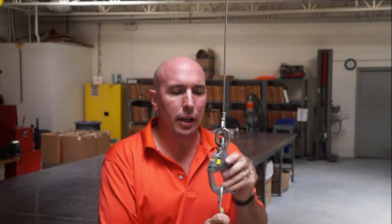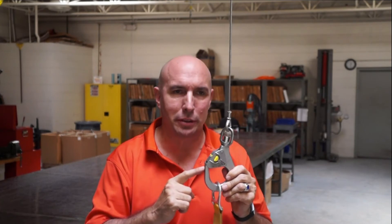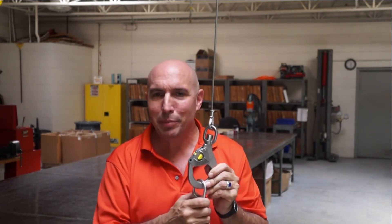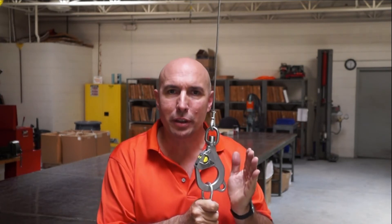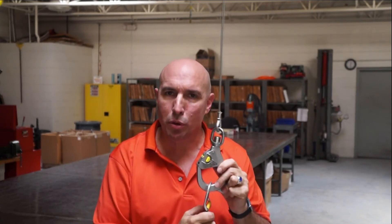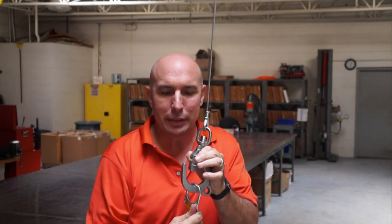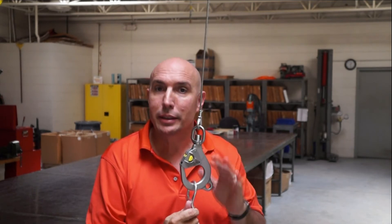This is a D-lock hook — D for double lock. It's a positive locking hook. The important thing for ring rollout is there's no beak on this device. What you're looking for is a hook that doesn't have any beak sticking out. If something is hanging out there it makes it a little easier to connect, but we're not in the business of things being easy — we're in the business of things being safe. With this device, there's nothing to grab onto to roll out of. The gate is locked; I couldn't push the gate open with the ring if I tried. I have to get in here, press, and open. That's a positive locking hook, as opposed to a manual lock where I can lock or unlock it and leave it that way.